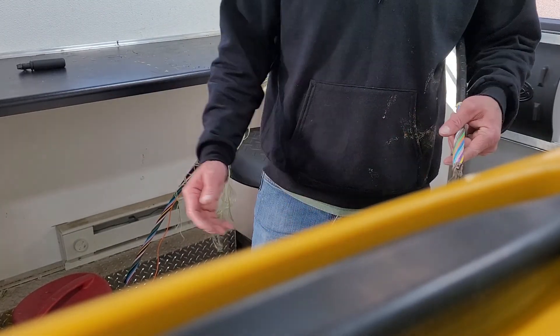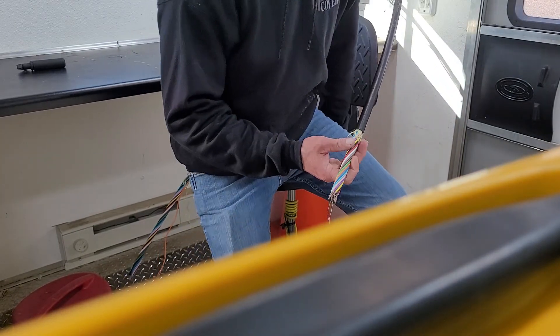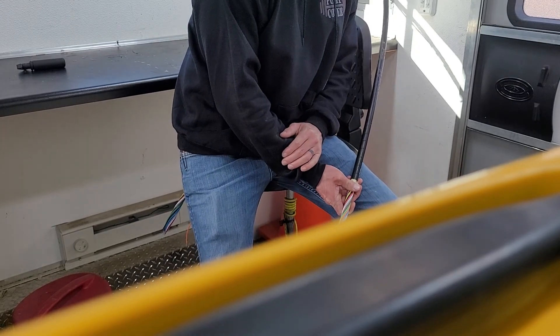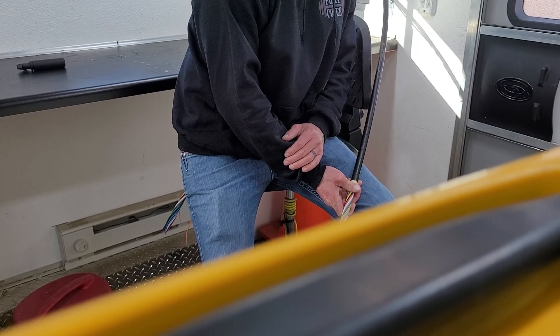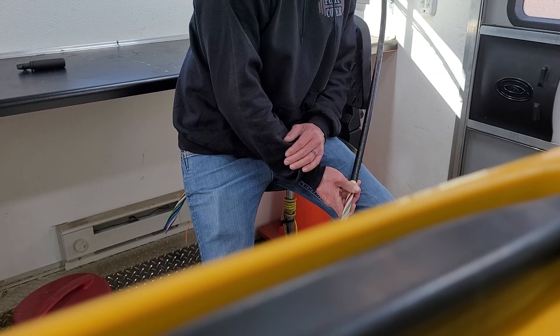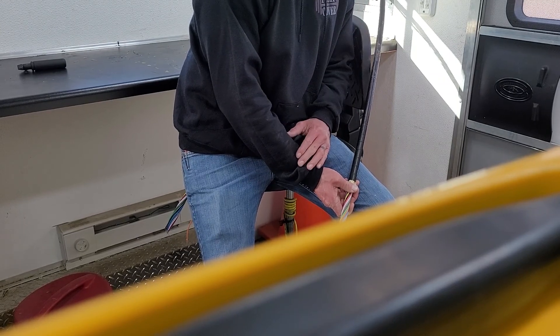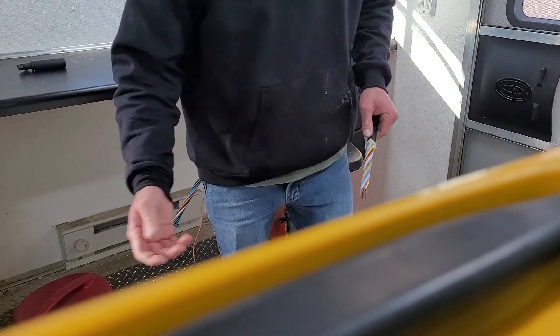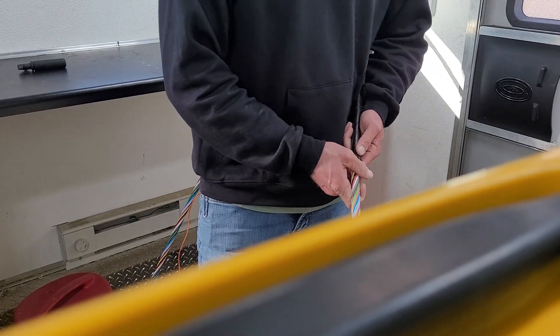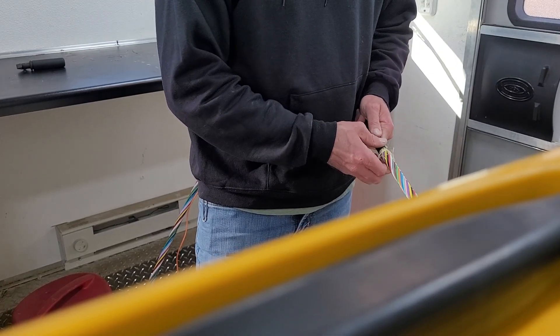If you've never dealt with a cable like that, that's great — I hope you never do. I personally have, with 192-count, 24-pair buffer tubes with gel on them. I've heard from large nationwide contractors who've worked with those cables forever — they mentioned specific brands of fiber optic cable that were worse with that than others. So maybe it's brand-specific. If you've never seen that, probably got better fiber or it's not old enough or the conditions haven't been bad. Hopefully you don't because it makes for a bad day.